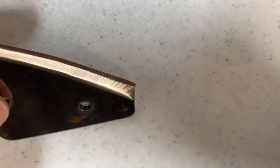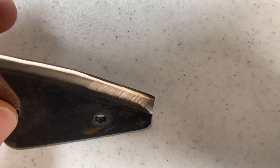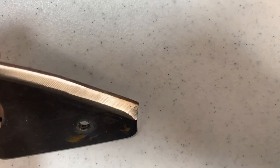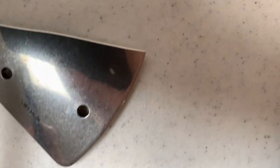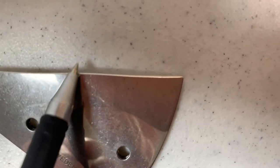So this looks like it could be the mate to one I sharpened before, but no — that's too coarse of sharpening. You can see there are two levels of sharpening here: the coarse at the top and then that second level. These have been sharpened twice because the factory sharpening is more consistent — it's done on a machine. But this one also has that on the backside and it's a little bit higher there. Just a lot of steel removed. Whoever did this is the one who removed too much steel, and it probably cut being crooked. Then as it got dull, they tried to cheat and go to the backside.